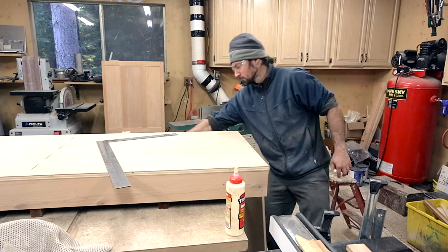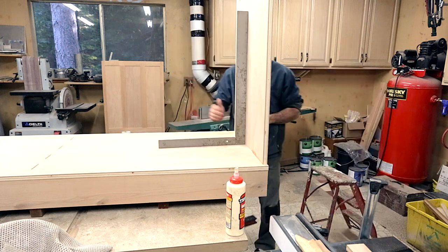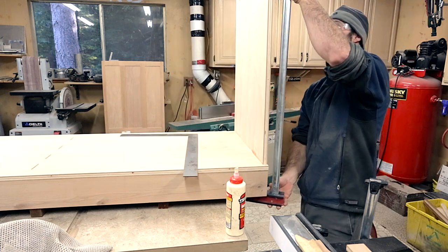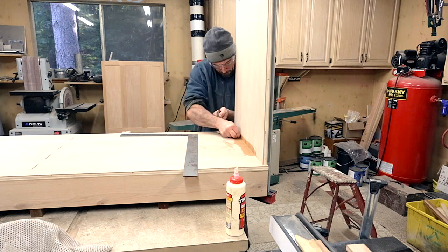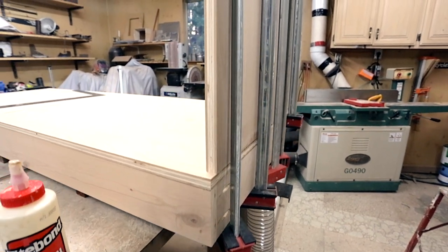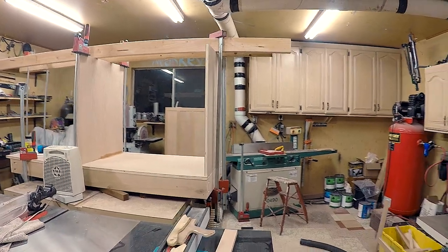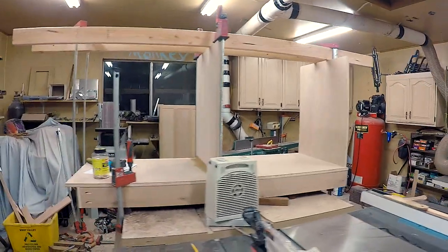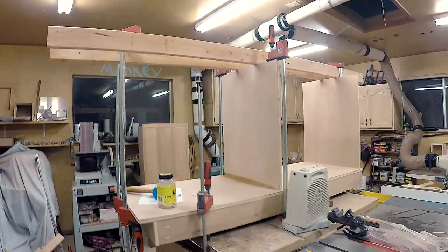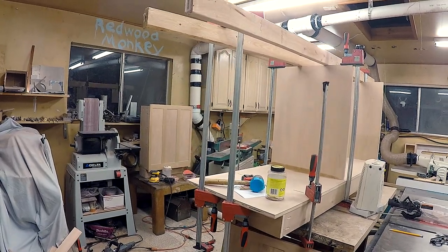There's nothing too fancy about the glue up. I like to use a lot of glue and wipe off the excess with a damp rag, also scraping it with the corner of an old utility blade. After I get one clamp on I like to align the pieces with a framing square — it is important for the clamps to have it set pretty close to 90 degrees, otherwise everything will be a little bit off. I can sometimes rack the clamp left or right to adjust the angle. The glue up of the middle piece is the same but clamping requires some creativity — I sit a 2x4 or 2x6 on top and clamp each side down. It takes some finesse to do by yourself but it isn't too difficult.